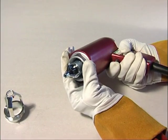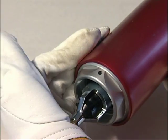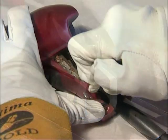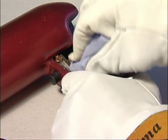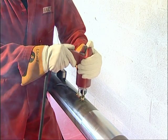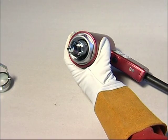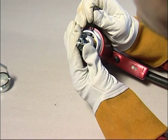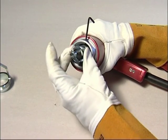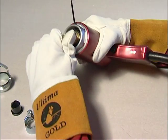Simple repairs and maintenance to the gun include ensuring the pin holder and front piece are securely fastened and that the pin and ferrule are a tight fit within the jaws of the holders. If they are flared or misshapen, they must be removed and evenly adjusted either in a vice or chuck. Contacts are cleaned, tightened, or replaced when necessary using the allen key and open-ended spanner provided in the toolkit. The contact nipple is replaced whenever any resistance is encountered when trying to eject the fused wire — never force the button. To do this, first remove the ferrule holder, insert the allen key through the hole in the front piece and into the securing hole on the centrepiece to lock the solenoid and prevent it from turning. Then remove the pin holder along with the spark shield and guide washer, insert the peg spanner into the contact nipple and turn anti-clockwise to unscrew.